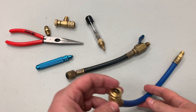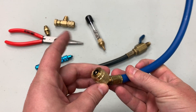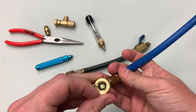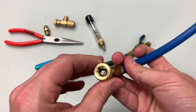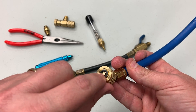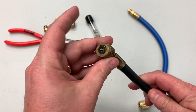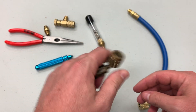This is a core depressor inside of a quarter-inch typical AC connection port, which is really a flare fitting. You have the rubber seal around the outside and on the inside that's your core depressor. These two hose ends are a little different in how the core depressor works on the inside.